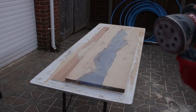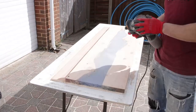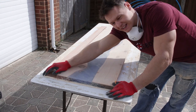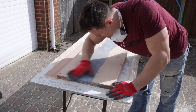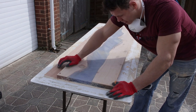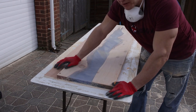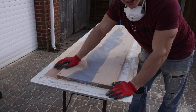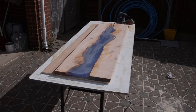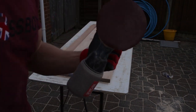Back to the orbital at 120. I actually went back down to 80 grit with the orbital, but now there are very few scratches — especially linear scratches — in the resin and the timber. So now I'm going to go back up to 120, go over it, and keep creeping up. I've got up to 400, then I've got polishing compound, but I might need to go even higher. Going with 180 grit, then 240, then 400.